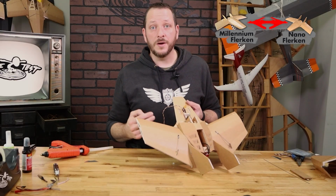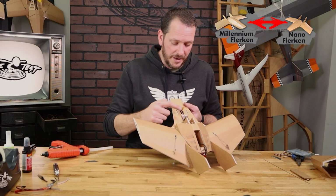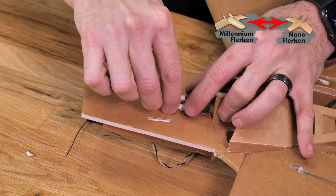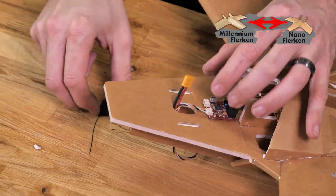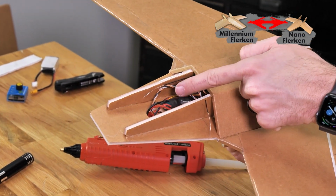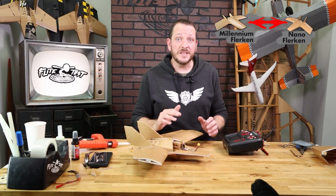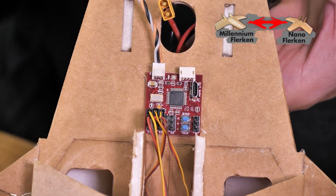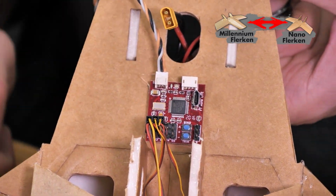It's really important to make sure that all your signal wires are lined up to your signal pin and also in alignment with each other. Just to keep everything neat and tidy, I'm going to mount my lemon receiver on the very bottom and then move my antennas to optimize them at 90 degrees from each other. So at this point, our FT Aura 5 is hooked up the way we want it. Throttle in 1, left elevon in 2, and right elevon in number 3.